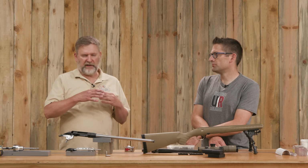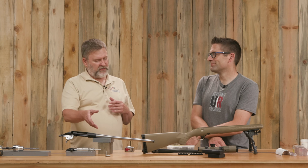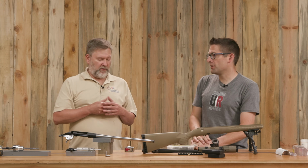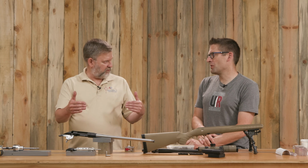The cheat that we use is the Manson reamer holder. Yep, the floater. What that does is it just allows the reamer to follow that hole. So if for any reason, and there probably is from manufacturing, the barrel's not perfectly straight, that will take up any error. If you have an inexpensive machine or an old machine that's got some wear, a tailstock that's not perfectly at the right height would be a common thing. Most guys know that they have to align their tailstock in windage.